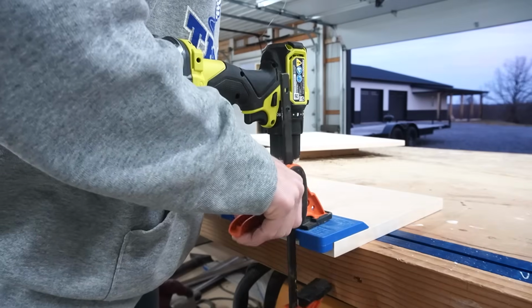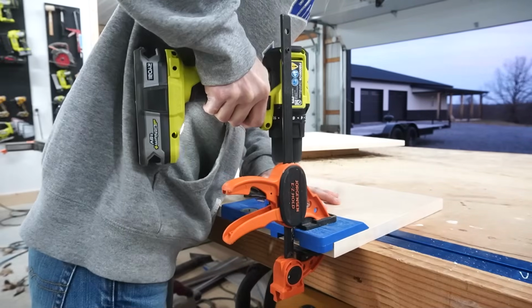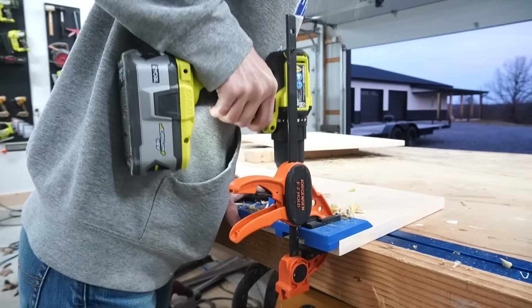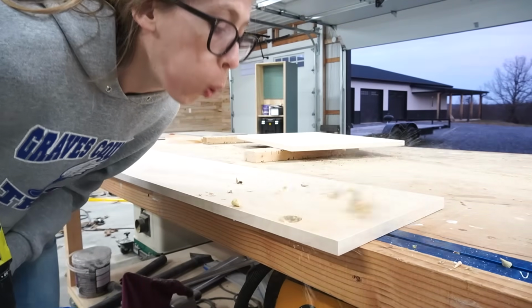Then I cut 2 inset 3/4 inch plywood doors, one for the tall narrow cabinet and one for the dresser cabinet. I have a guide for how to size your cabinet doors that I will link below if you want more information on how to cut the doors to fit.